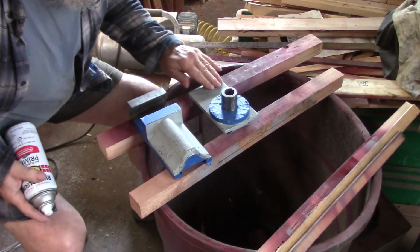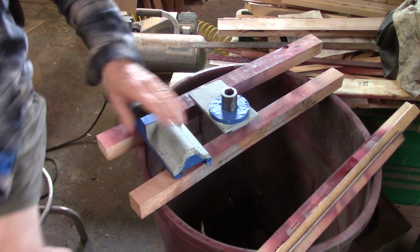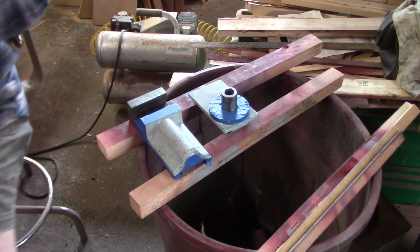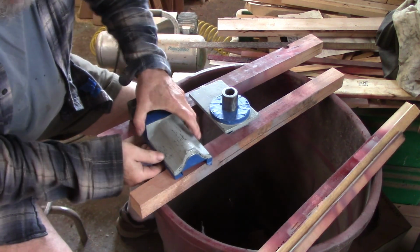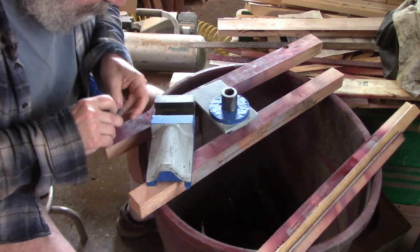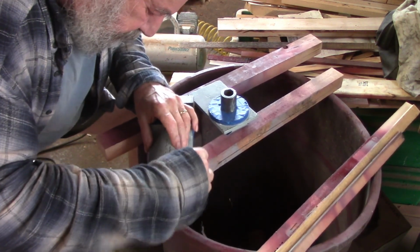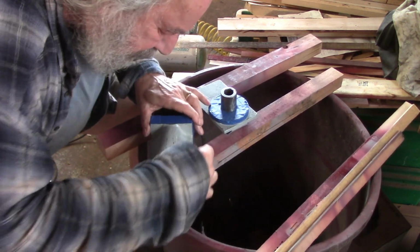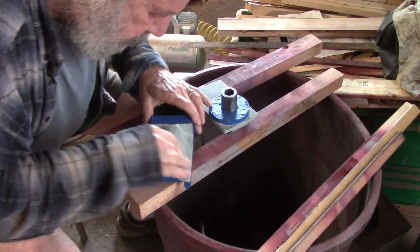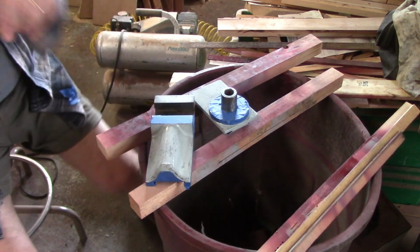Well, let's see how this turns out. These have been cleaned, sanded somewhat, degreased somewhat. It's got a spot in it. It's a dent, or a missing paint spot, which means it's got edges, which means it'll telegraph when I put the primer on. I don't know if you've caught on, but I'm not sanding the primer very much at all. Okay, good. No sharp edges.